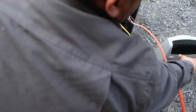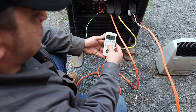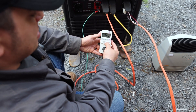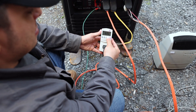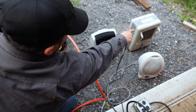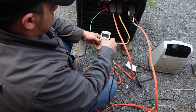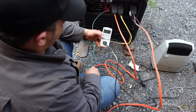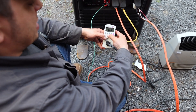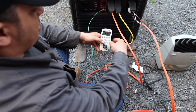Here's our first heater — that's on now. We're at 123 volts, 12.41 amps, 1,520 watts, 60 hertz. Our second heater over here is cranked up the whole way — plugging it in now: 123 volts, 12.36 amps, 1,520 watts, 60 hertz.